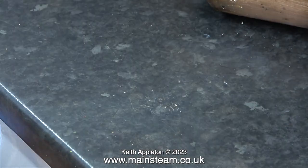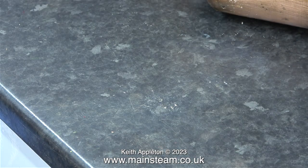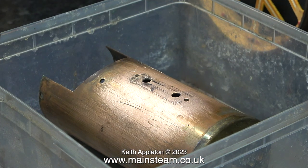After wiping away the residue from my bench it was clear that something needed to be done. The boiler's not going to be very efficient with such a coating of lime scale on the inside. Plus lime scale in solution can be quite abrasive, which isn't good for the moving parts of the engine. You will notice in this clip, as it sits in the plastic tub, I have started to clean up the outside of the boiler too.